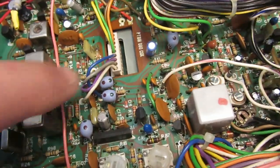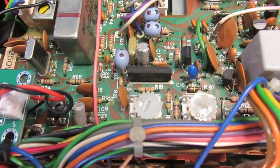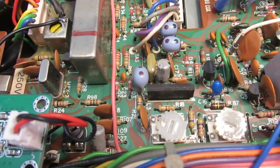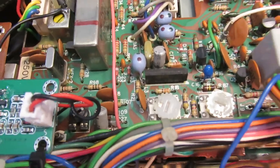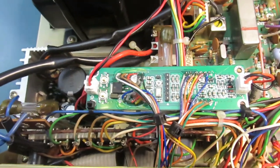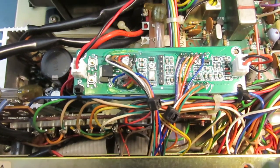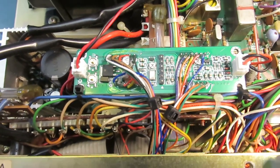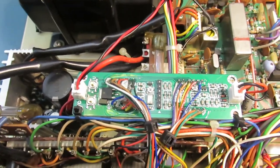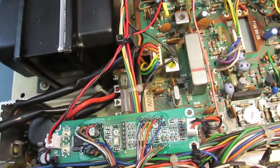So like I was saying, this first place I tapped into had lots of signal, no worries. But the second place I actually needed, it was pretty weak, and the counter didn't really want to read it. So I had to change my whole philosophy on the counter, because once I hooked it up, it was so sensitive to the whine, it was just bleeding in. I'm like, okay, this is a good reminder on why almost every time I put a counter in, I gotta physically go around and find the best grounds, the best place to put the hots.